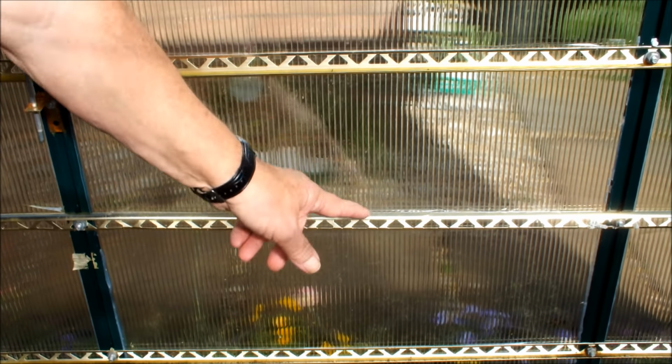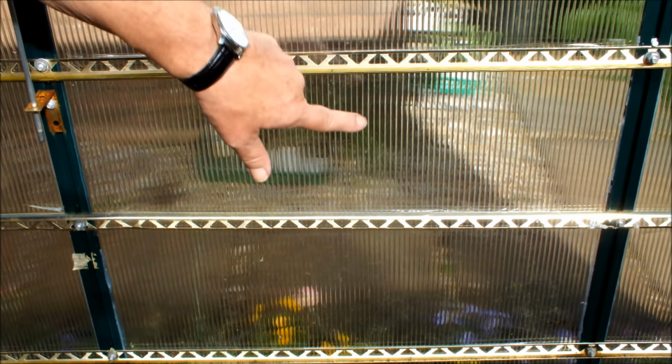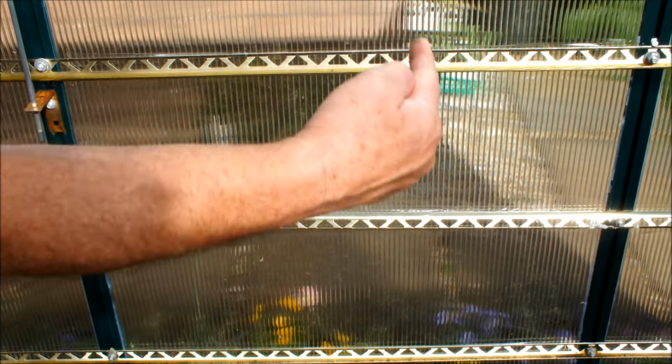These strengtheners stop the panels blowing in. You can see that. But they're not actually secured to the panel. So if the panel wants to blow in that direction, if the wind wants to suck it out, these are not going to provide any strengthening, are they?